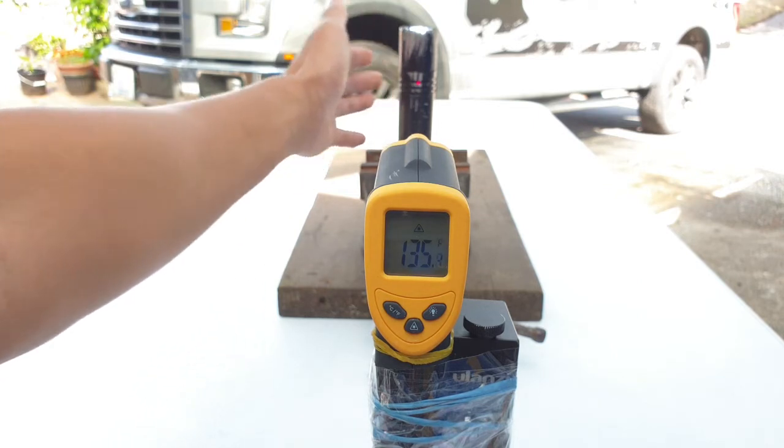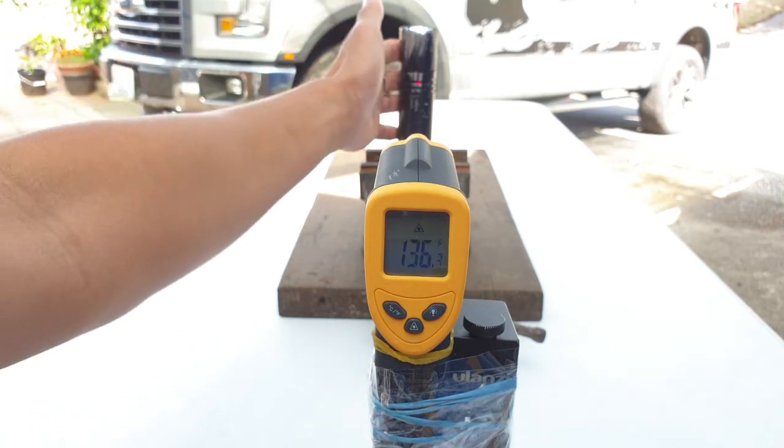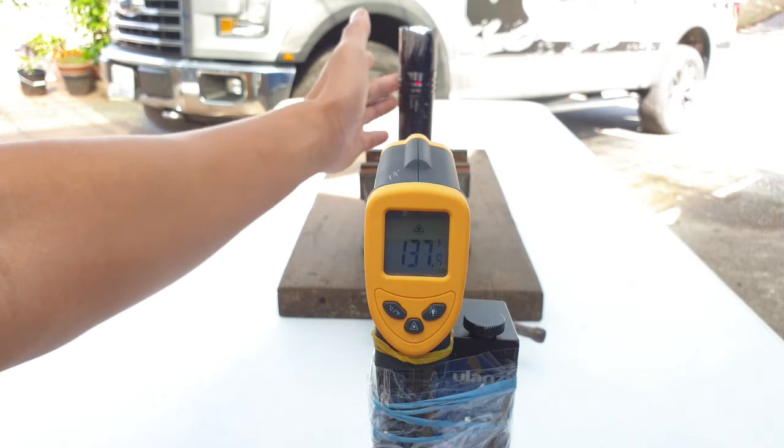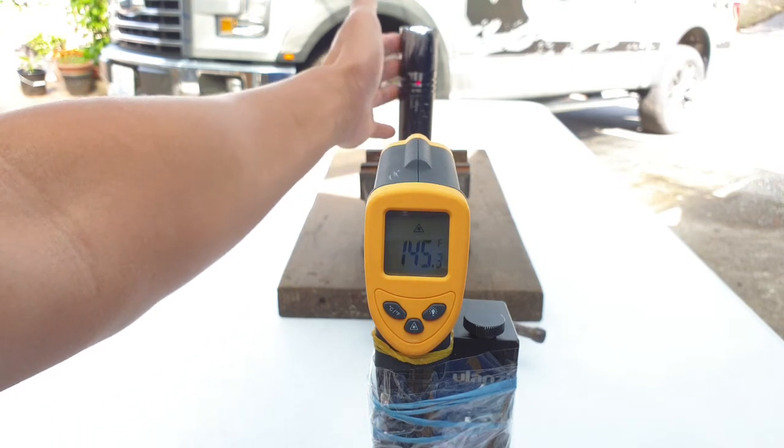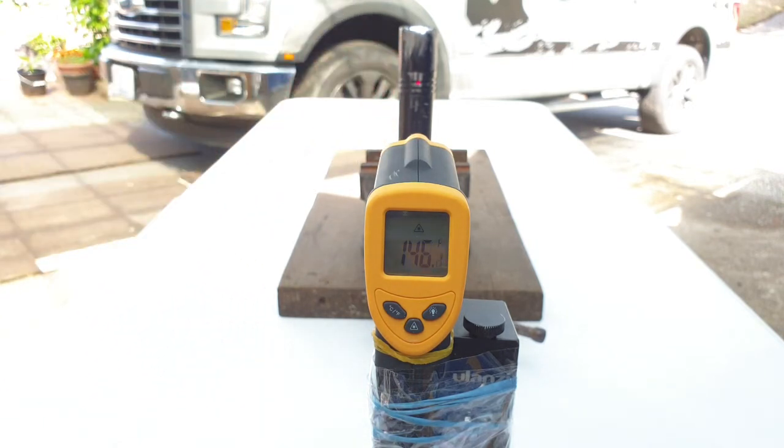I would say two and a half minutes is about where the safety point is for this specific battery. We're still running the same quad W2 light engine. Now we'll just watch for the temperature to rise and see when it will actually dip — it will dip when there's enough voltage sag. So we went from seven minutes with the protected cell down to two and a half minutes with the unprotected cell.